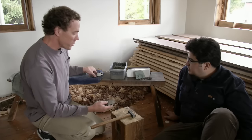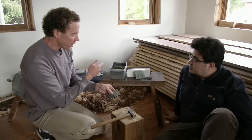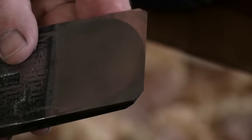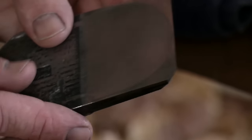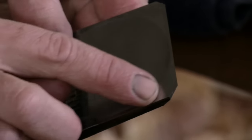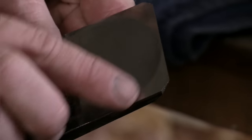If you don't tap out and you just grind the blade down, the hollow will eventually reach the edge of the bevel. To bring that flat back, you can grind it on a coarse stone, but that will bring the flats on the sides in and you'll eventually lose the efficiency of the hollowed-out back.